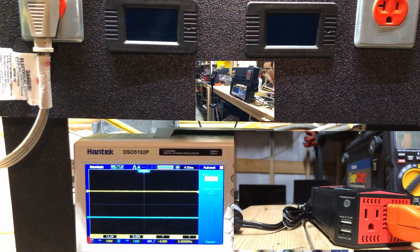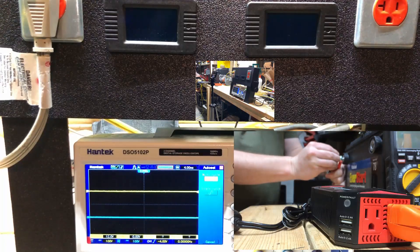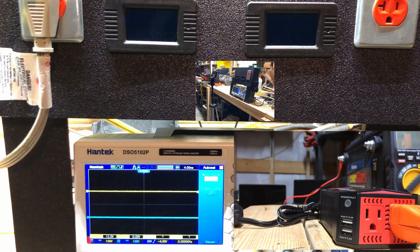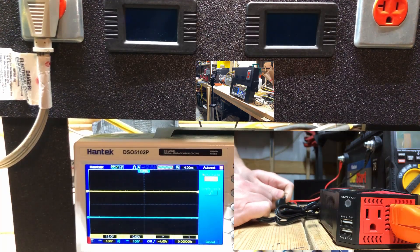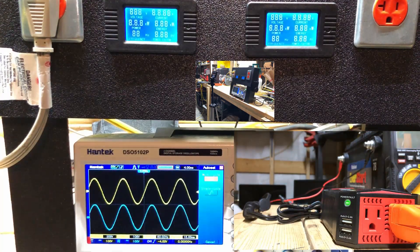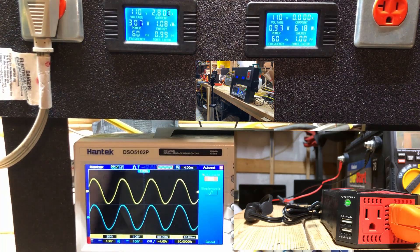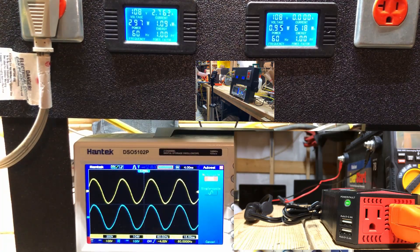Let's put a bigger battery under it. All right, so we've got a bigger battery on it now — let's see how much we can get out of this one. 260 watts... 306 watts, that's more like it. 110 volts, 109 volts, 304 watts. Now that sine wave is beginning to kind of change shape a little bit under load, but it gets better if we take just a little bit of load off.